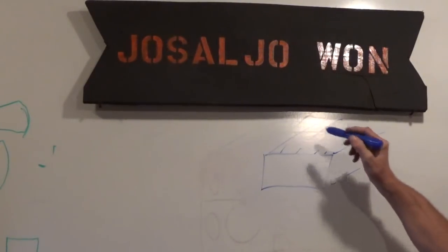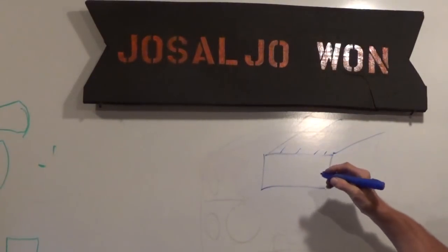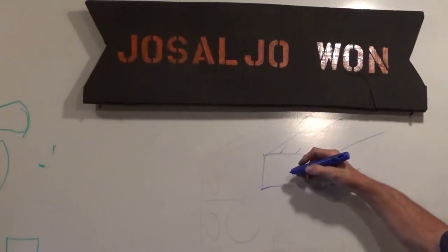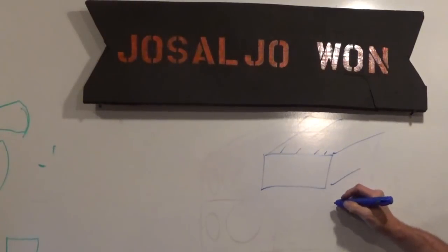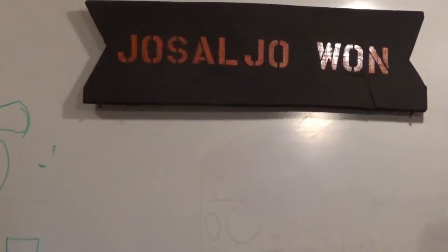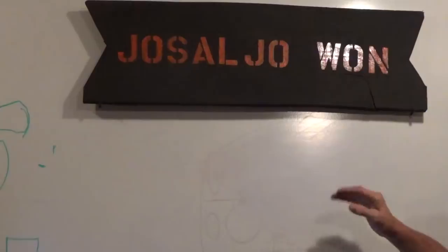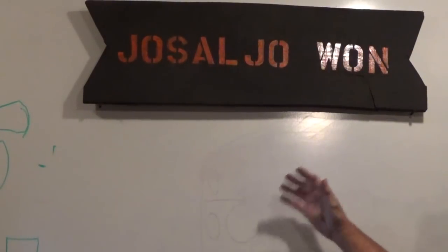But what's going to happen is I'm going to dry all of these until they get down to a certain moisture content. Sometimes I might lose more moisture in cherry than I do in red oak. So I've got to be careful of what's happening there and how fast it happens. It doesn't matter if it goes all down to 6 or 9% or whatever you're looking for. What matters is that it does it in a slow process, okay? So this is where you want to keep the relative humidity around 30% all of the time.